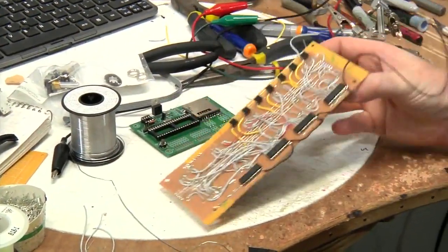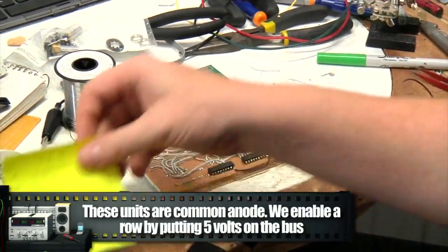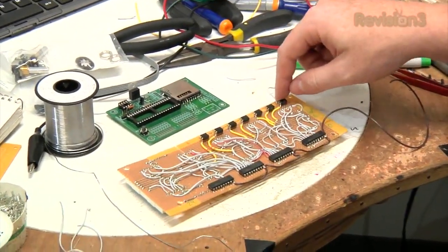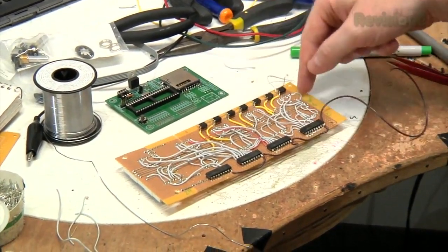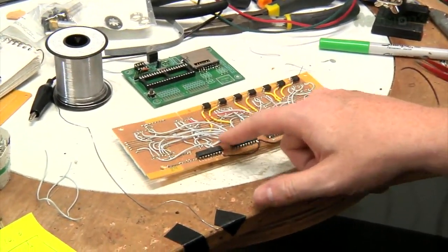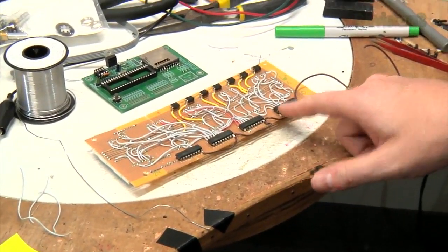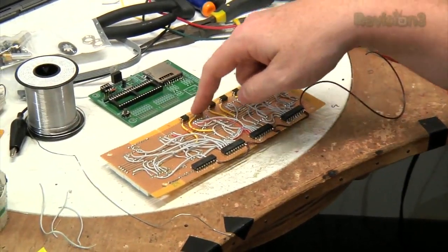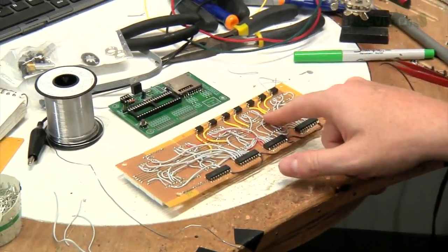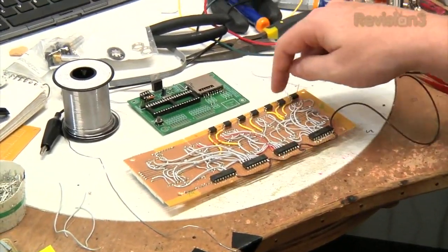Here's our LED matrices and how we're going to drive them. This bus has seven lines indicating the rows. We're using MOSFETs — positive five volts comes in, but only one is triggered at a time to activate which row lights up. Then we have Darlington transistor arrays to allow the dots to sink to ground; these are hooked up to the microcontroller. We're going to use a Johnson counter to cycle through the rows using fewer pins.